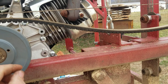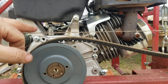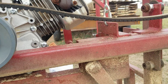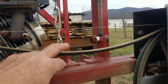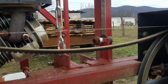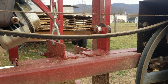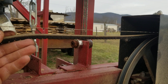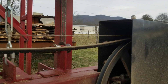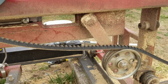I've been breaking these blades so bad, and I've been getting this flutter — where my blade's sitting there doing that all the time, even down here at the bottom. Running the big pulley and the belt, when it came off I really couldn't get it tight with my tensioner here. So I'm going to step back to a smaller pulley and a shorter belt, see if maybe I can get it tighter. Plus, this will be lower, so as it comes off my driven pulley over there it'll be lower, and hopefully the flutter won't get to it.